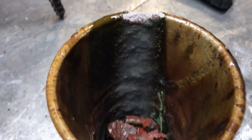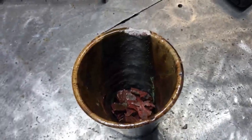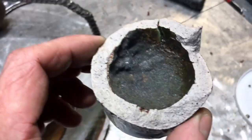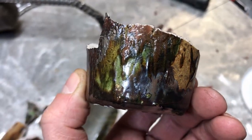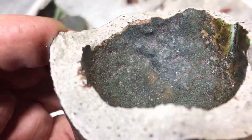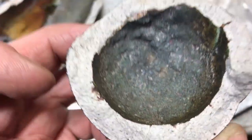I wanted to give this another try, but it is unfortunately raining in the dead of winter — it should be snowing right now. This is what I ended up with. I don't know if that's metal powder we're looking at, which it does subtly resemble. So I'm going to break this crucible — it's already busted anyway — and get a better look at what's going on inside. I believe it cracked because I have a direct flame impingement foundry for the highest temp possible, but it's just not good on crucibles. I'm going to build another cyclone unit eventually, and I'll bust the oxyhydrogen torch out on that and see if I can ball it into a little bead of metal.